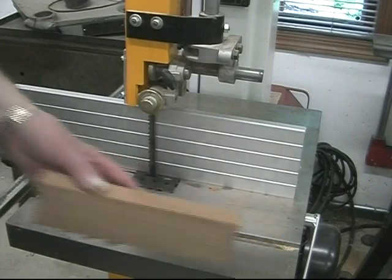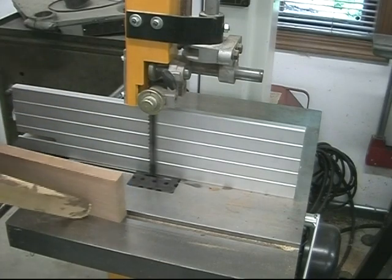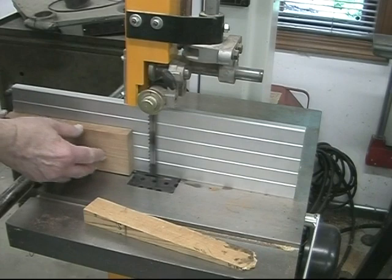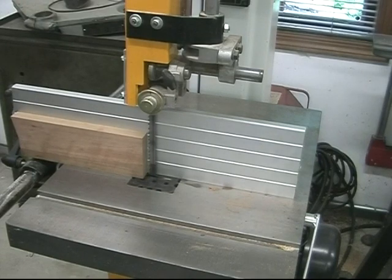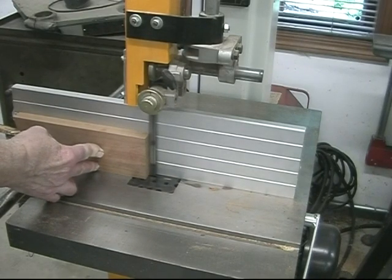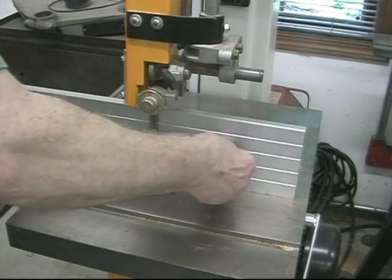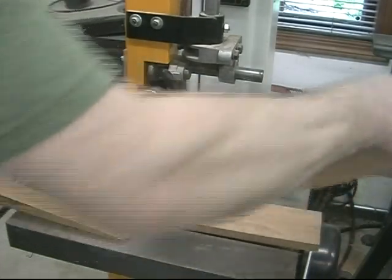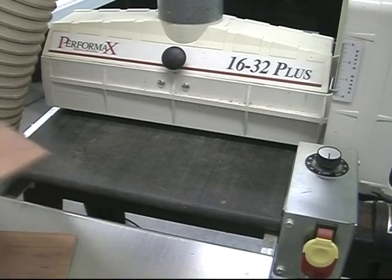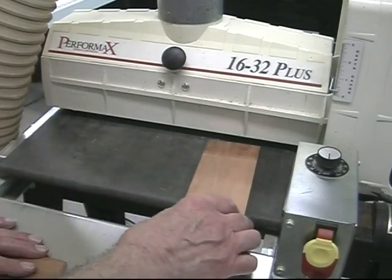The next step is to cut the little slabs from which I'll cut the circles. I have the bandsaw set to about 1/4 inch. Each gear is about 200 thousandths thick at the hub. The next step is to sand the boards to thickness, and I have a surface sander, part rides on the belt.